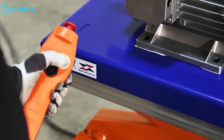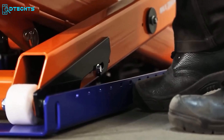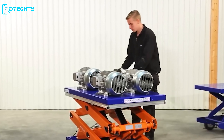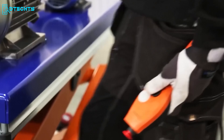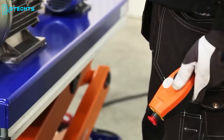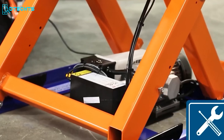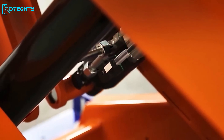Next on the list is the Scissor Lift Table TLD-2000, a material lifter and height-adjustable workbench that gives easy access to a higher height range compared to regular workbenches. You can adjust the length between 900 and 5,000 mm for individual demands. With a 5,000-kilogram lifting capacity, it can be used in automotive workshops or construction sites. It complies with standard safety methods, has an IP54-approved electrical system, and features adjustable trap-prevention safety trip bars, making it a worthy option for instant working platforms and pallet stacking.